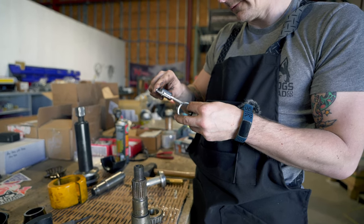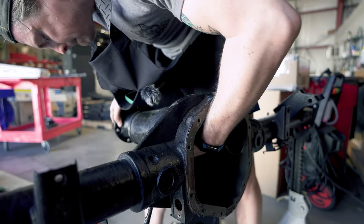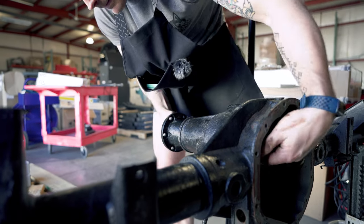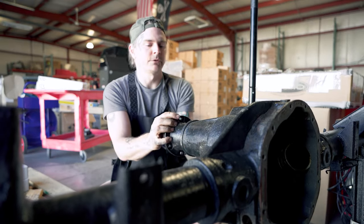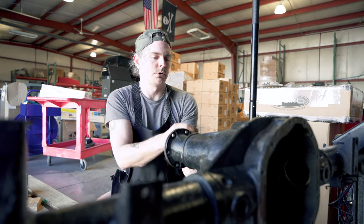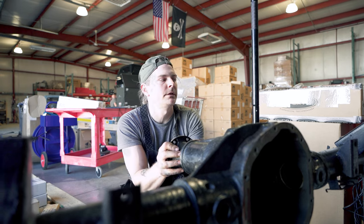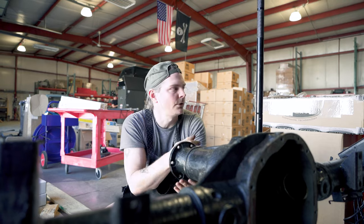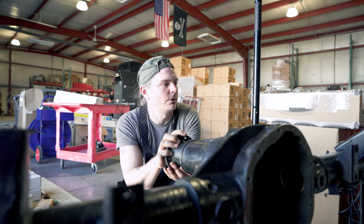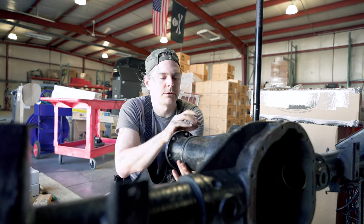We're now at 0.5635 — we'll see what that does. You want to feel a slight drag. I typically don't take an inch-pound measurement; I just do it by feel, and that feels good. That may be our winner right there. It'd be nice if it were just a hair lighter, but the shim stacks we have won't allow for that — I'd need something like a 0.005 shim, and I think 0.009 is the smallest in the set. So I'd say this is about as good as we're going to get, and I'm happy with it. As you spin it a little bit, it starts feeling even better.